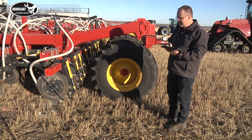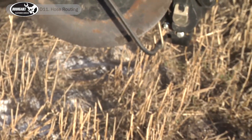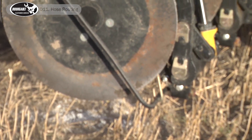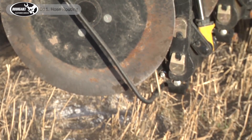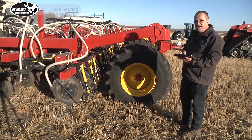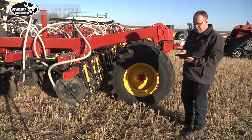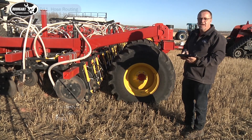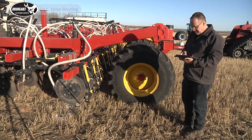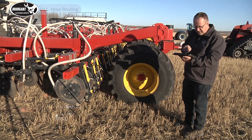You can hear the product coming. We can see and check our runs. I'll turn that off, the line is clear. Then I'll check section seven. You'll systematically check all of your sections on your fertilizer. Then I'll turn it off and turn off the fertilizer clutch.